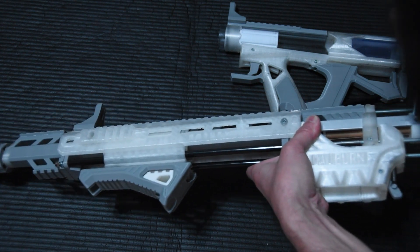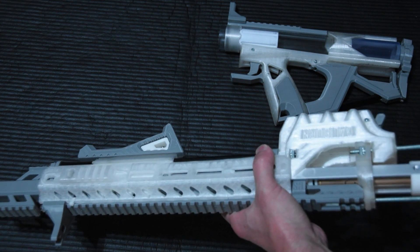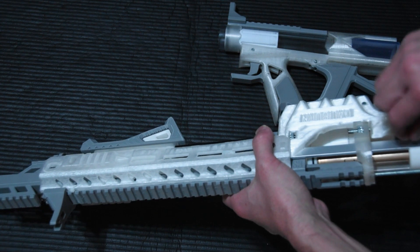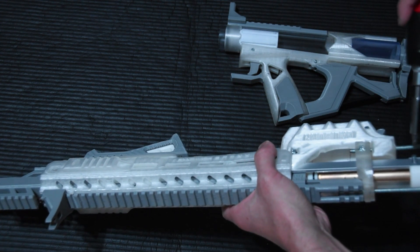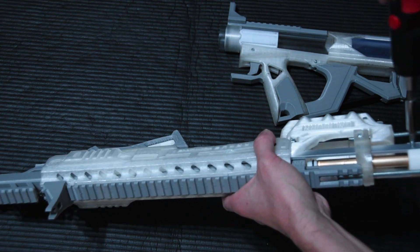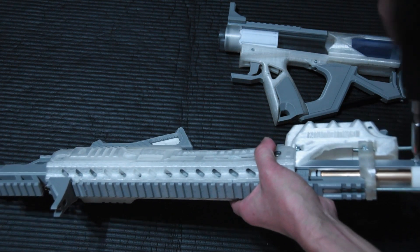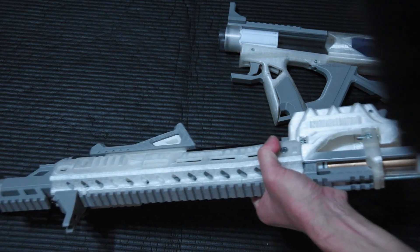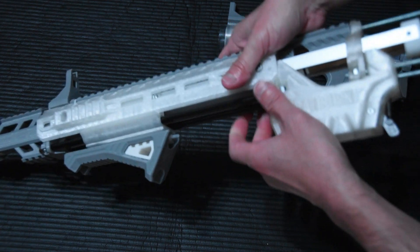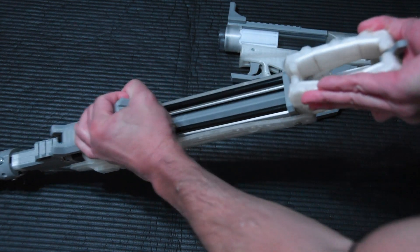We've got a pretty good lock right there. One of the things I've noticed with the TPU is I made the holes smaller in the RAM base, so there's a little bit of stretching as that 4-40 hardware goes in to seat it into place. You might actually be better off using wood screws rather than machine screws, because you want more bite in a softer material. I'll run this through the tests, and you can do your own tests to see whether it's giving you a good grab or not.